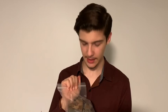I had to calculate the exact volume of this and then convert that volume of cast iron into mass, and that came out to be about 2 pounds, 1 ounce. So I've got 4 pounds and 2 ounces here, because when casting and melting cast iron, a lot of it gets lost to slag. It cools down in the crucible pretty fast sometimes, so I'm just going to melt a ton and then pour the rest into a graphite ingot mold if there is any left over. This is from a cast iron sink that I had, and I banged it all up, beat it into bits. So I just weighed that out.